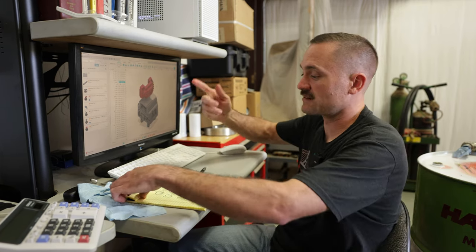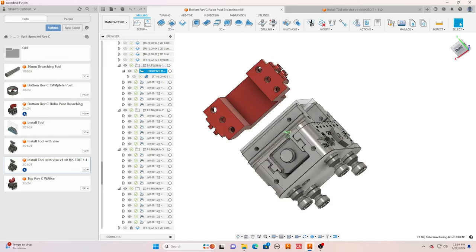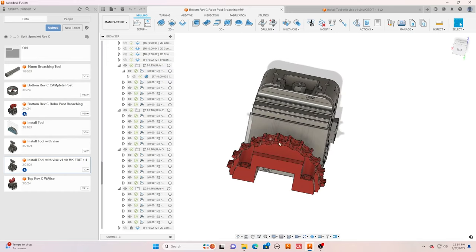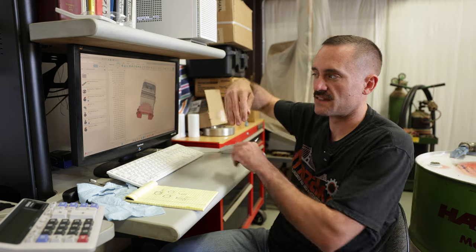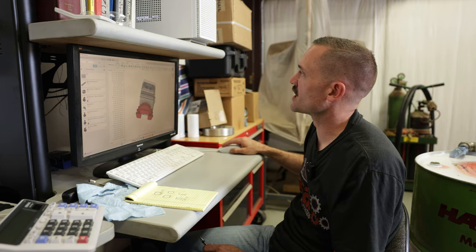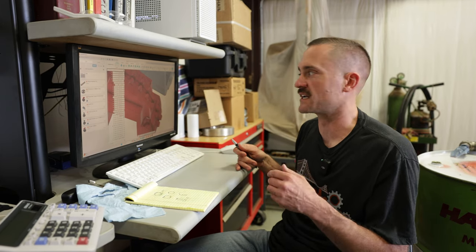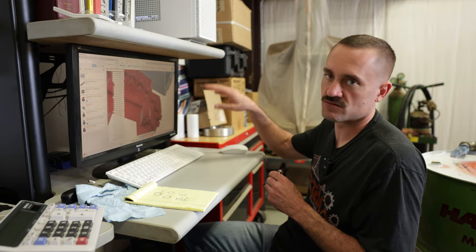Post your code — no hand-editing. The other great comments brought up in the YouTube video were like, why didn't you rotary broach? One of the main reasons is that this Z height is so high that I would have had to have had a custom rotary broach made. And the way it works with the wobble, being longer than whatever distance, that has an effect. A lot of the cutting pressure would be higher because we're cutting into the corners and taking out 32 thousandths of material six times on my tiny little BT30 spindle. A spline isn't really cutting — a spline is swaging, kind of like a roll form tap. So that was the reason, quick and dirty, as to why we decided to single point on that last video.